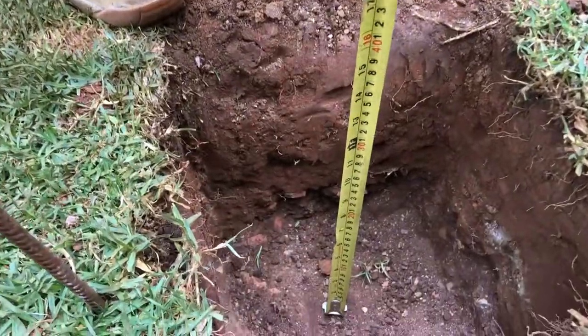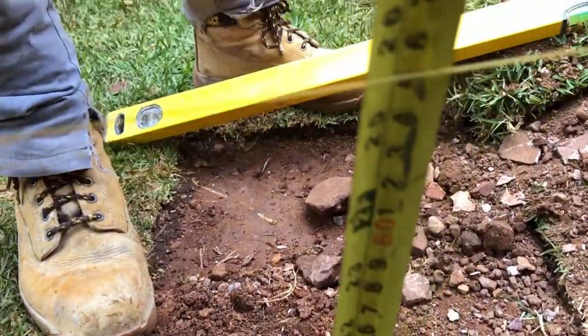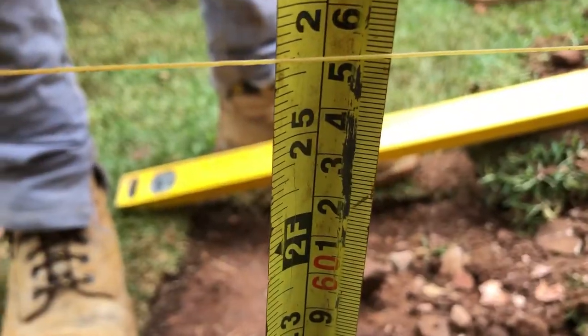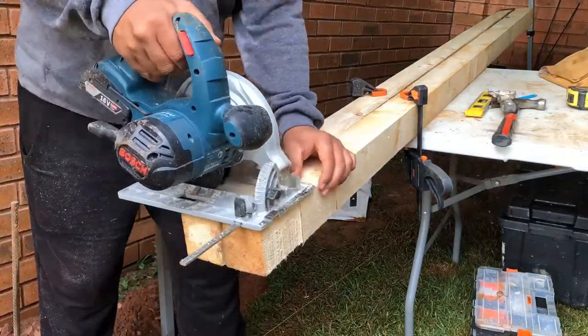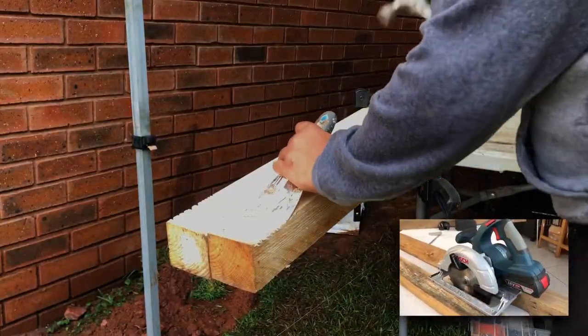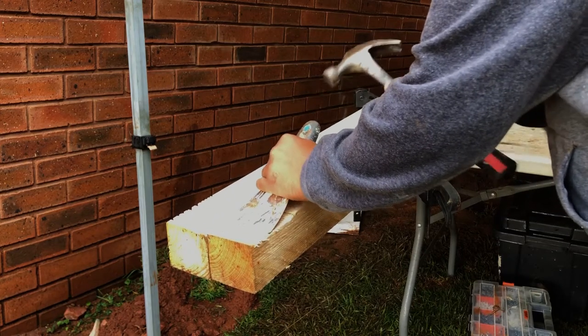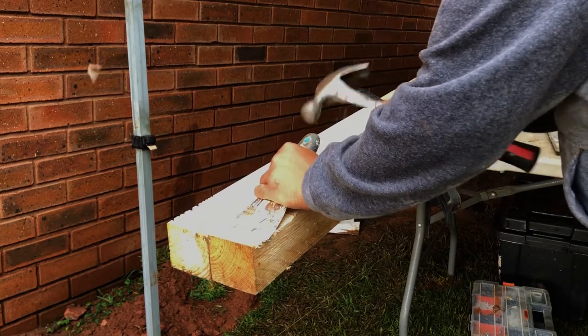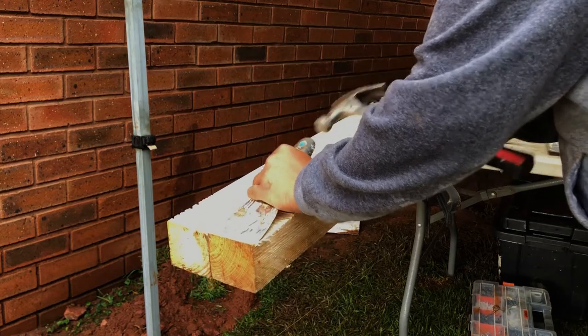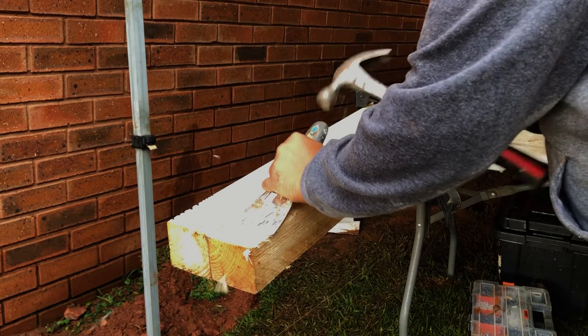You can see the difference in slope, but in a later project we're going to be leveling out the area so that the homeowner can enjoy a level surface. Go and check out the tool review we did on the Bosch cordless circular saw — it's a nifty tool when you're doing woodwork. We used it to cut out a 10 centimeter, or about 4 inch, recess of the wood — just a sliver — so that it can fit into the metal post bracket. Then we cleaned it up with a hammer and a flat scraping tool.